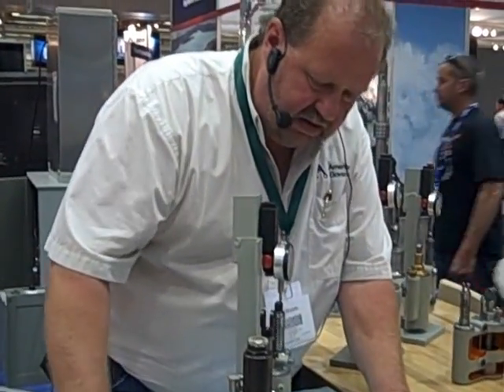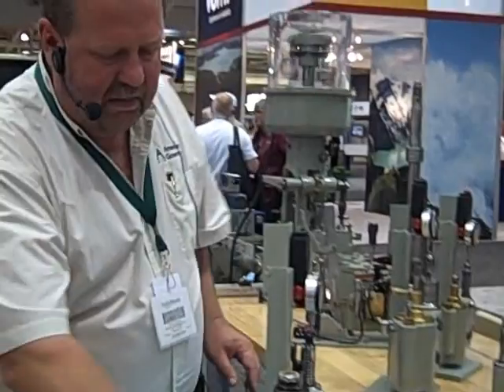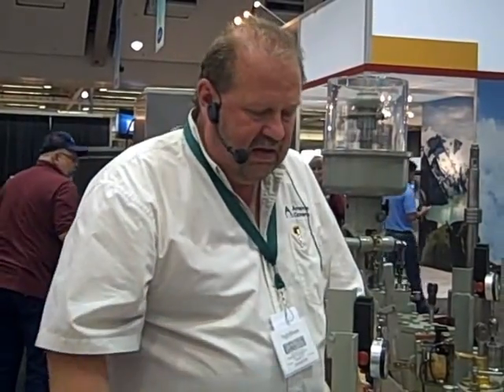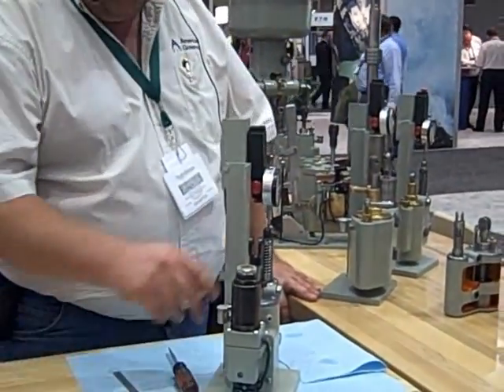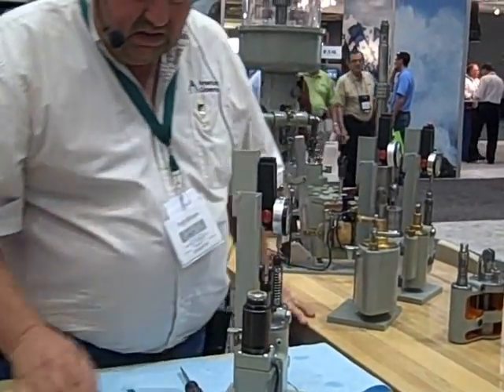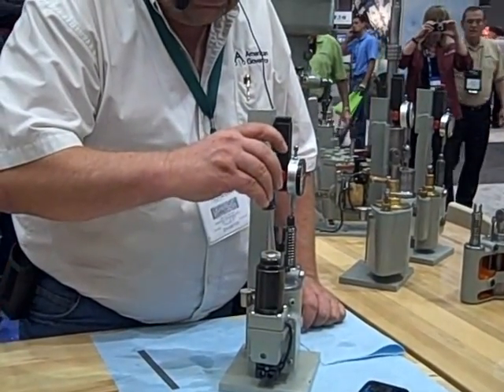It's very typical that you'll get about... I'm going to stop it there — I got a minute and 19 seconds. Now that could have gone as fast as 30 seconds and this dashpot would still be good. This is a test you can actually run at your own plant with your dashpot. You can see this little setup I've got here — it's nothing fancy, just a dial indicator and something to mount it to.